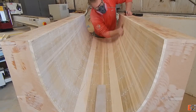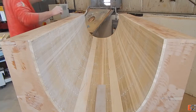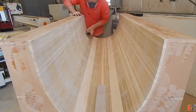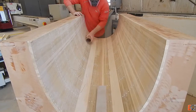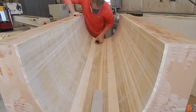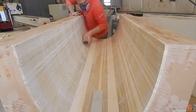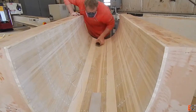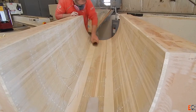Just went over the whole thing pretty well — cleaned up the ends, cleaned up the top, and got it ready for fiberglass. I outlined some of the areas where it felt high by hand with a black Sharpie, then went back and sanded those spots with 36 grit on a piece of cardboard tube. Worked really nicely.